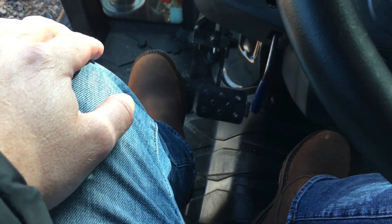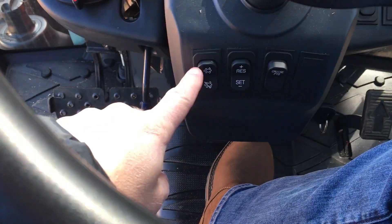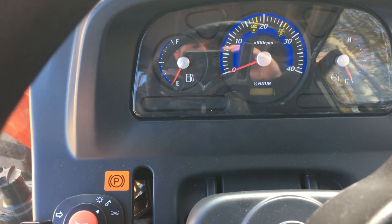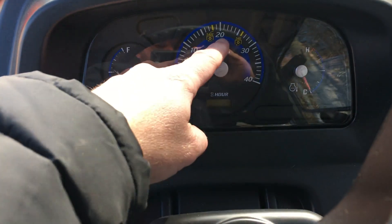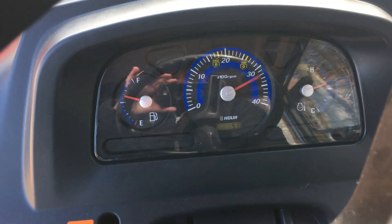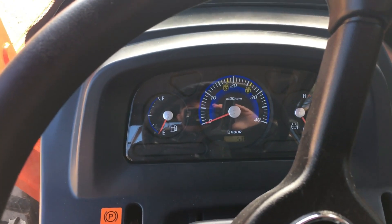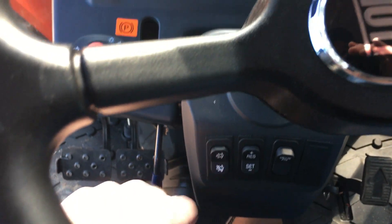It's just like an old school tractor. You got your shifters here for your tractor tires and your parking brake. It's also got a regen. Basically, if you run this machine at 540 RPM or higher — which is right in between 2,000 and 3,000 RPMs — the regen will not come on. But if you're running below 540 and that regen light comes on the dash, it gives you 15 minutes to regen the machine. You put the tractor in neutral, put the parking brake on, hit the regen button, and leave it alone for 15 minutes.